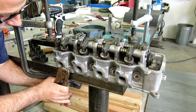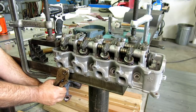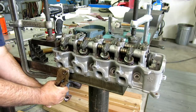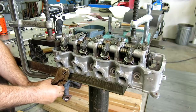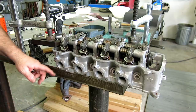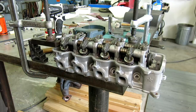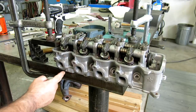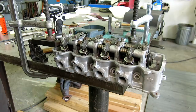So that's what's happening. Get it nice and tight. What I'm doing is alternating the direction and just trying to wiggle the thing loose. I can see this end's turning and I'm looking through the crack here and the other end's not turning — so it's actually going to do what I want it to do for the video anyway, and shear off there. So now what? Once it failed in torsion for the full diameter like that, no easy out is going to be able to hold on the inside of that. So drilling is really the only practical solution.